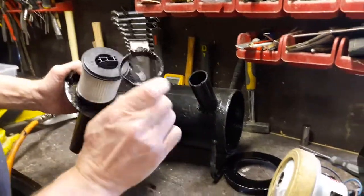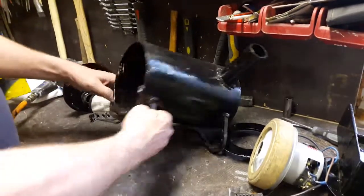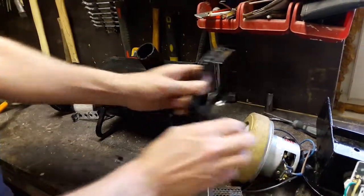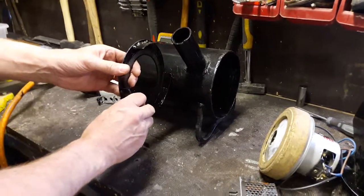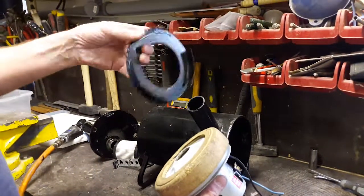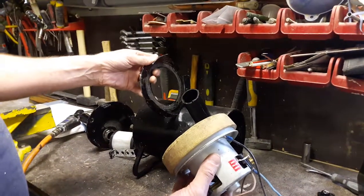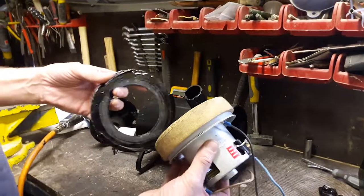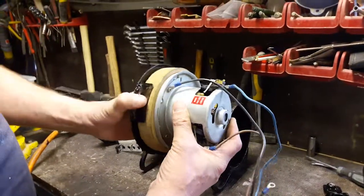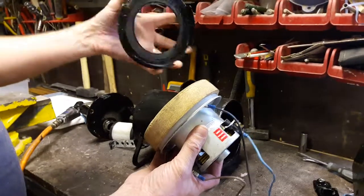And there is a holder for this piece like that. These bolts are attached to these two screws here. Then, in the middle section, we have a plate that allows different kinds of blower motors to be installed. So this gives me flexibility. Instead of welding this into this piece of pipe, I put some studs or some ears inside, and then attaching this allows me to use this specific vacuum cleaner motor. And then it's quite easy if I later want to change it to a different motor, to just modify and make a different adapter for that.